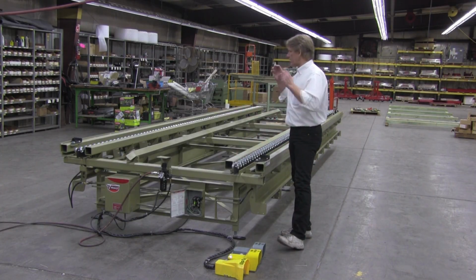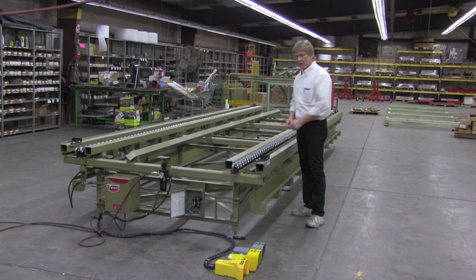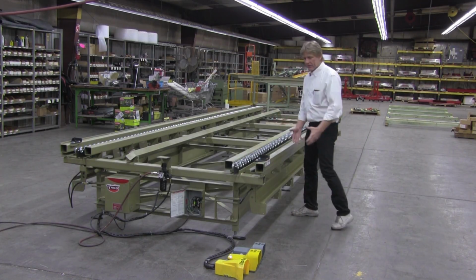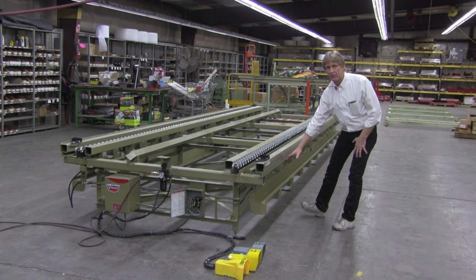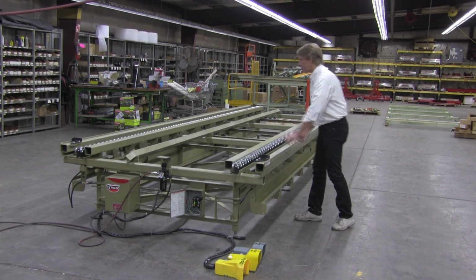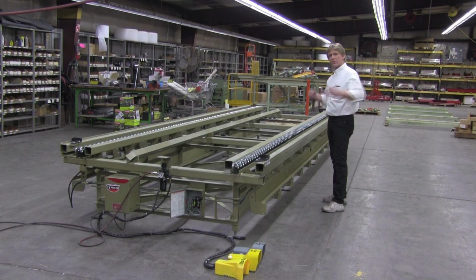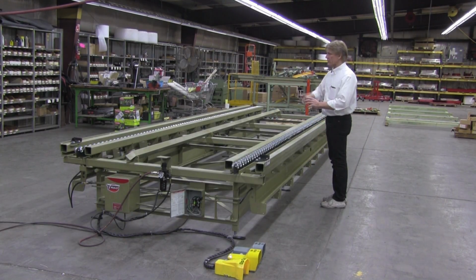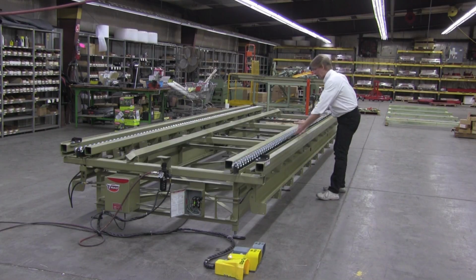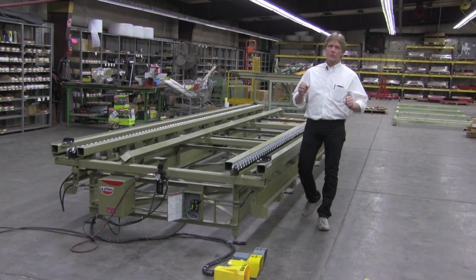So for the most part, you're going to put in your door and window bucks, clamp the wall up, go ahead and nail everything off. In this case, the customer did not buy dolly rails. This is a strip down machine. Hands down it is. They're going to nail everything by hand, utilizing the LightBar as far as locating everything goes, as opposed to using the cast iron stud locator flippers that we currently have on our other products and our other tables. When it's all said and done, you open up the table, the skate wheel rollers pop up, you roll the wall off, and the guides start framing again. That's what you want to keep doing.